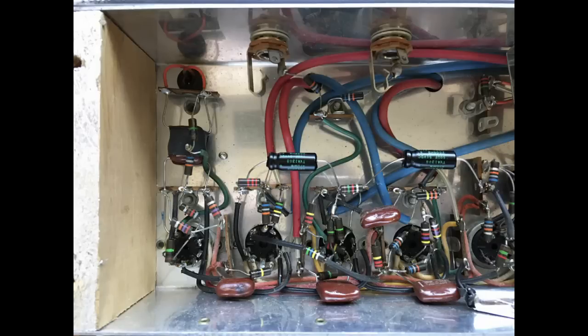They're also very prone to noise like hissing and crackling, especially in Fender and Silvertone amps. Silvertone amps have pretty much all carbon comp resistors and you really have to change all of the preamp plate resistors and a lot of the cathode resistors, because preamp plate resistors have high voltage applied and signal traveling through them. As those resistors and the carbon and binder materials break down over time due to heat, they start getting noisy. When I replace preamp plate resistors, I like to replace them with carbon film resistors because they're less noisy and way more reliable.